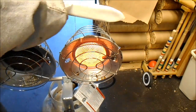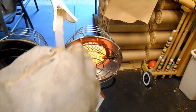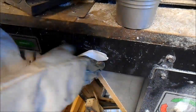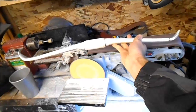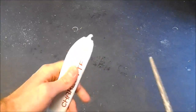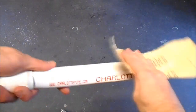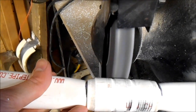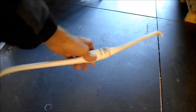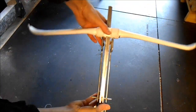Cut the ends so that they make a tapered shape, heat it up, put some hot glue in there, then press it together again so that it's thin out at the tip and bent slightly forward. This is mainly just for looks and to help the string hold on better — this isn't really going to help the performance even though it looks like a recurve bow. I also heated at the base of the limbs and did some work by hand without any mold to get it so there was no crease. Once the tips are smoothed out, file in some nocks for the string to hold onto, then sand the bow.